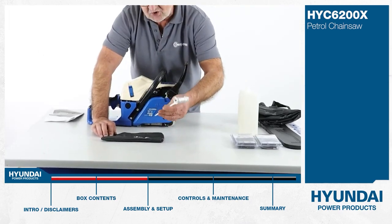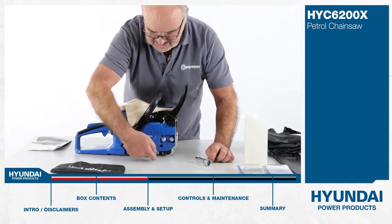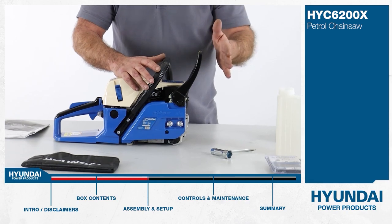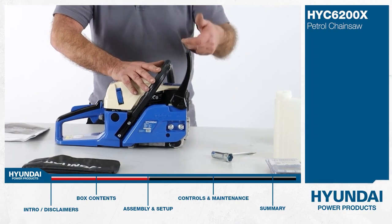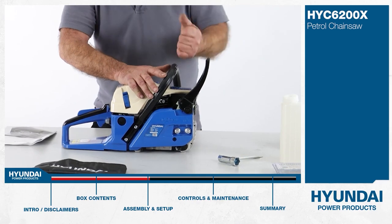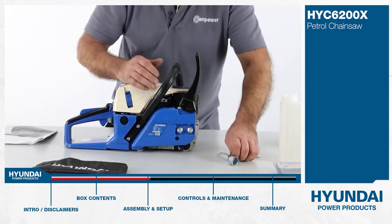So if I take this socket out of the toolkit, the first thing we're going to need to do is to remove the chain brake and bar cover assembly. To remove it, we need to turn the chain brake off. So this would be the on position. That would be chain brake off, and that will allow us to disassemble it. If the chain brake is in the on position, it'll be tight around the flywheel, we can't get it off. So push it back and chain brake off.